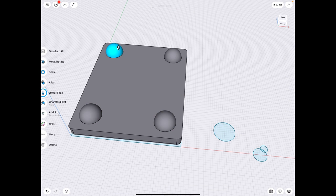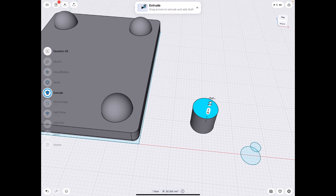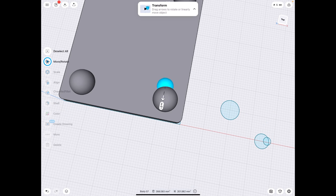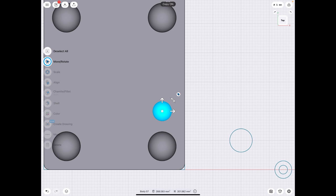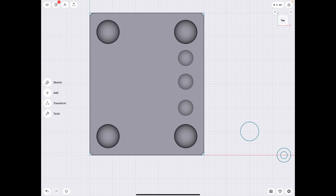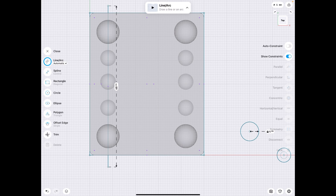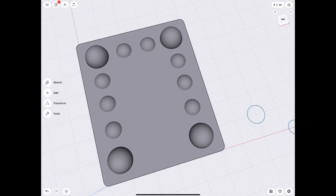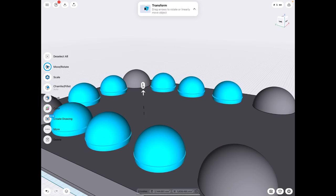Generally speaking, four corners is enough on a rubber mold, but in this case I feel like we might need some more. On this plane, let's make these smaller — we'll go to 4 millimeters, extrude to 8, drag those down. Same process as the corners, except we're just going to be a little more liberal with where we put them. Let's say three — doesn't really matter. I'm just loosely lining everything up so it's basically straight. We need to make sure they're all on the same plane so they're all halved — there we go.